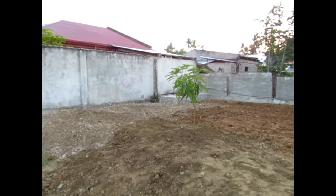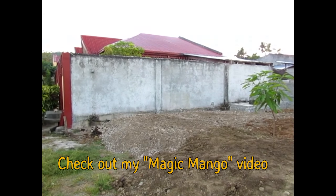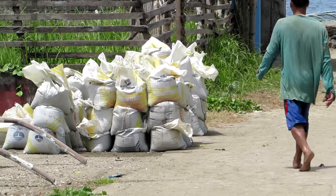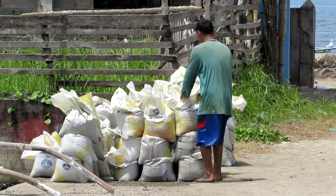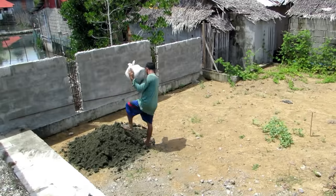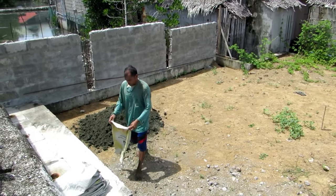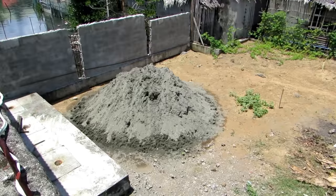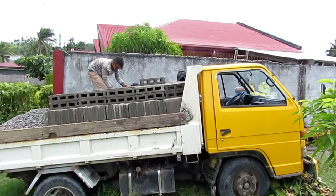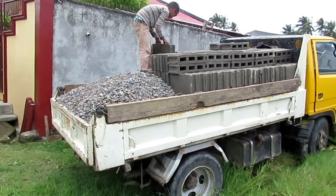Some of you might be looking at this mango tree and wonder how it got there — there's actually a video I did on how the magic mango tree appeared. I originally ordered 50 bags of sand, which was mistakenly turned into a 150-bag order. I had to let the sand sit for a couple of weeks to become seasoned, meaning about half a dozen rainfalls is enough to rinse the salt out of the sand sufficiently that we can use it for concrete.